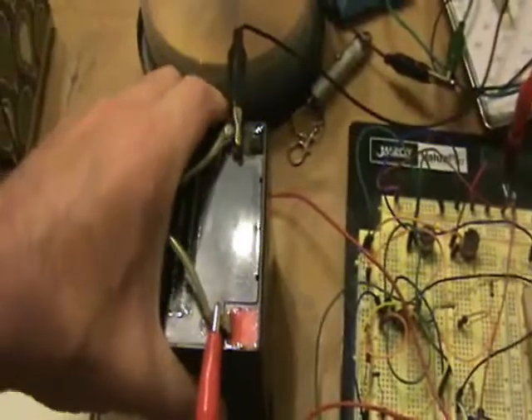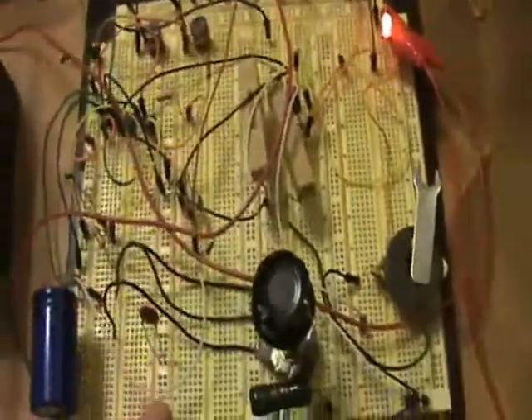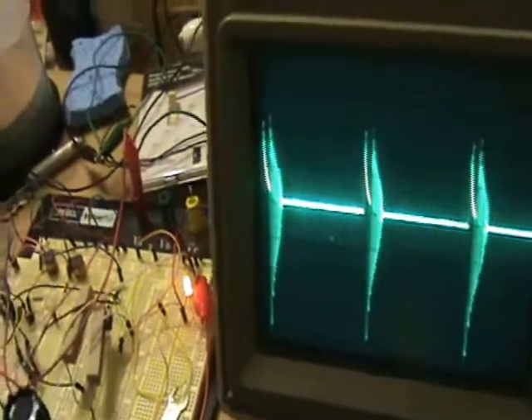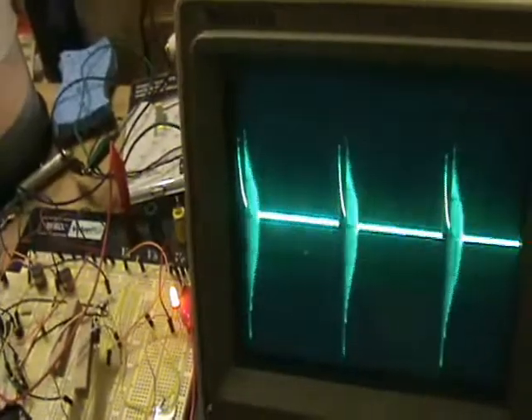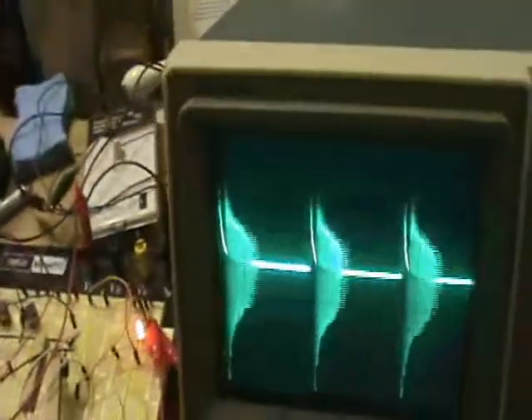The power supply reverted back to the battery because I was seeing dampened oscillation with the battery as well. These prototype boards are notorious for having capacitance. If I touch various things on the board — like this resistor — the dampened oscillation shows up. The ground plane in particular, if I touch it, will cause the dampened oscillation.